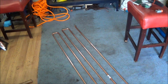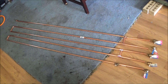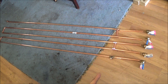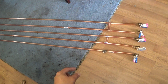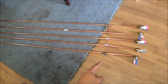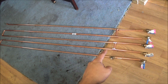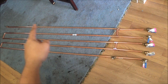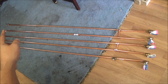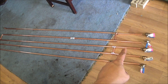Now that everything's cut, doing a quick dry run here. Right down here is where the air will come in — we'll have the compressor, and then a line that goes through the regulator and filter. The air will travel up and then back down, then through this tee, then up, back down, through another tee, then up. I've got a fitting up there where I can screw in a nipple to attach a hose that'll go over to the desiccant side.